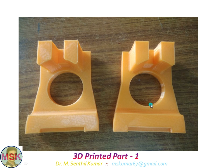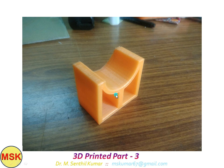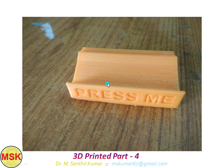This is the first 3D printed part — the two bracket-shaped component. This is the main roller. It has got three slots on which the chalk piece will be seated while in motion. And this particular hole is provided for fixing the neodymium magnet. This magnetic field will be sensed by a potential free magnetic sensor. Then this is another 3D printed item for fixing the motor over this particular member.